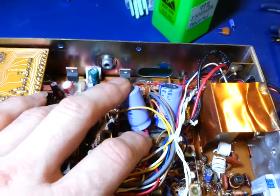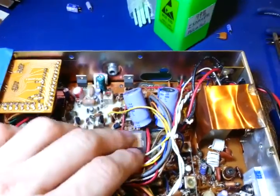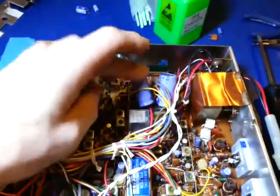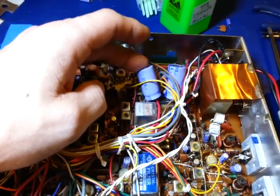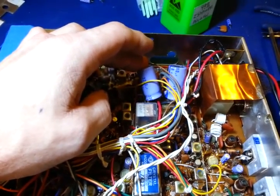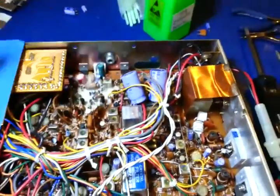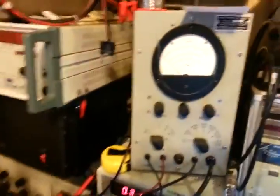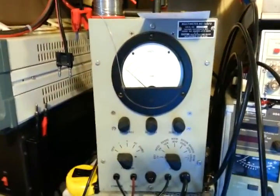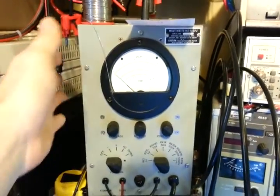This is a good example of why you should change your electrolytic capacitors — they're all going to go bad eventually. They don't last forever; they weren't designed to. Most of your better capacitors — better than what they use in CB radios — your modern radios use about the cheapest things they can. These were actually fairly good capacitors back in the 70s and 80s; there weren't many junk component manufacturers around then. But they're all going to go bad. Even your ultra-premium stuff is going to be mil-spec — military specification — like you'd find in equipment like this.